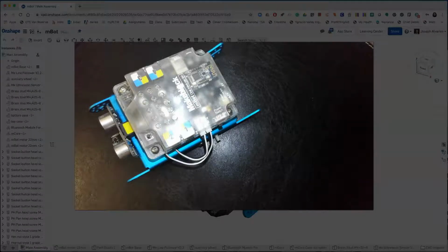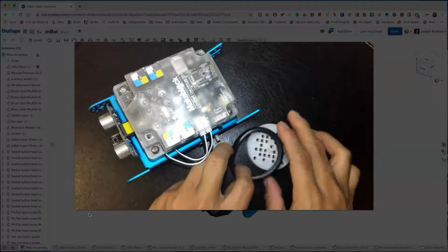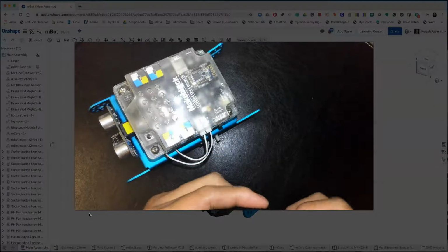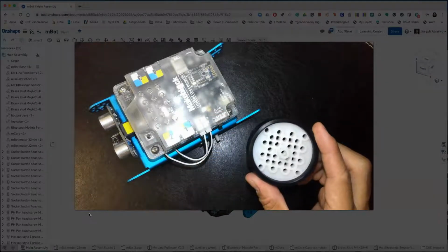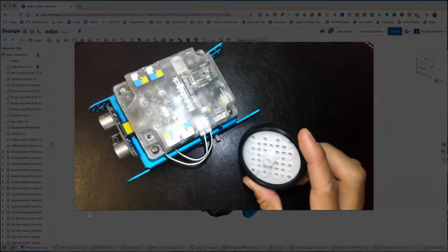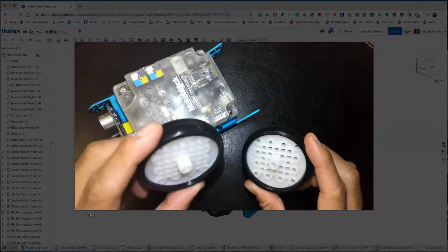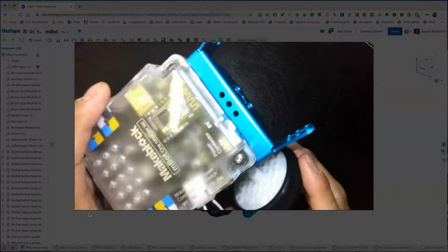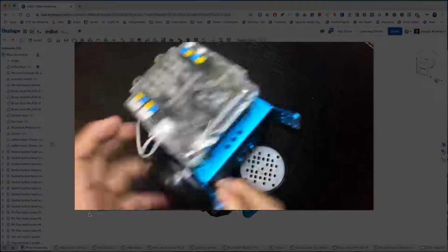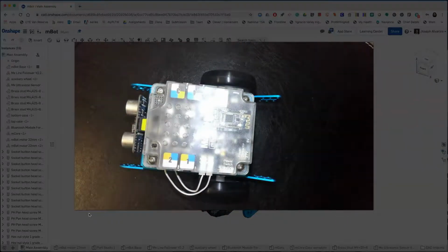In this lesson, we will import the 90-tooth timing pulley and the tire, and we will mate these two together using a fastened mate. Since we need two of these, we will create a subassembly, and then we will insert that subassembly into the main assembly. So we'll have two, and then use another fastened mate to add up the wheels.